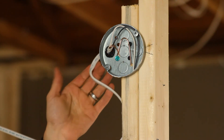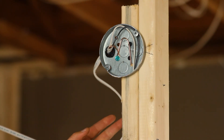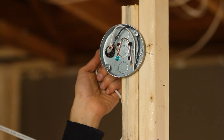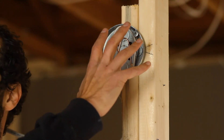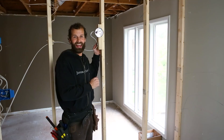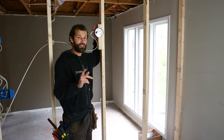This service loop is intentional. It must be within 12 inches from the point of securement to the box in this situation, but the service loop provides extra wire in case the wiring gets damaged when drywall is being hung over the surface of this box by a rotozip or a tool of that type. The length of the block that I cut is completely arbitrary — there's no magic to it.